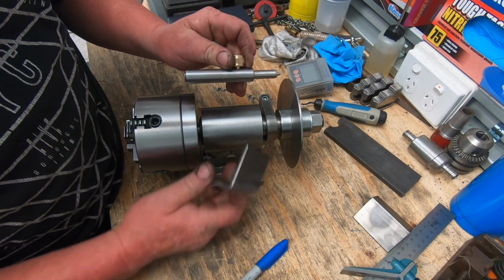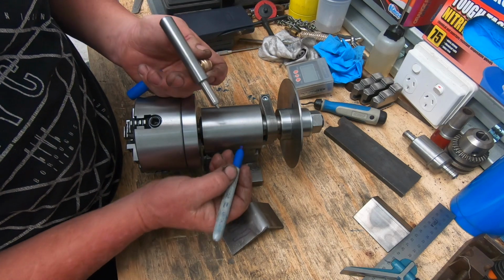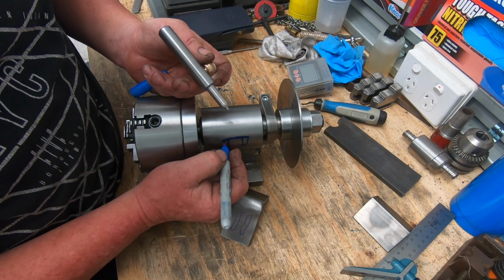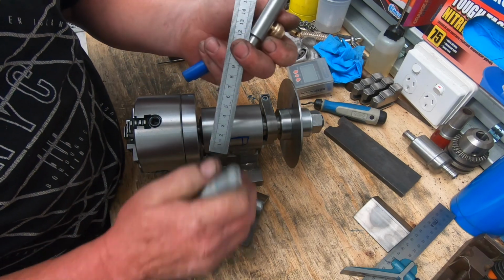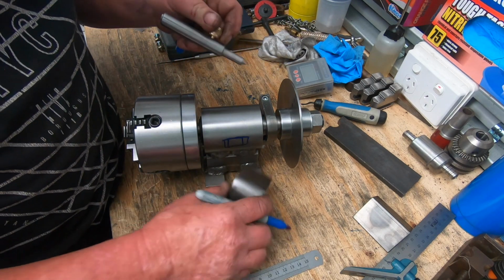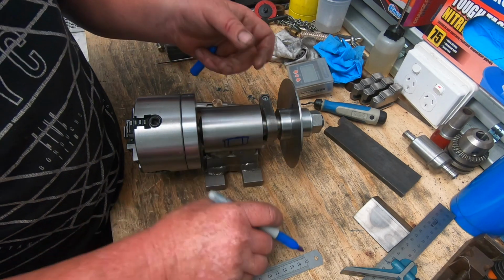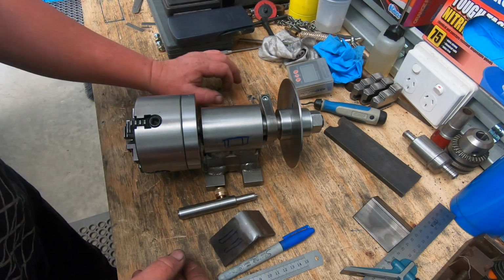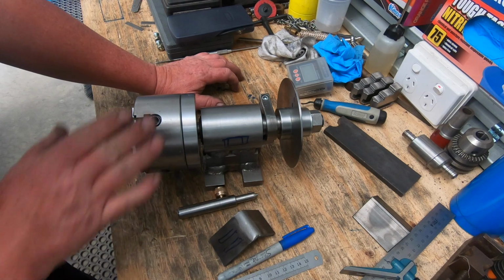So as I said, I'll strip it down and machine a flat in here, as wide as that, probably so wide. I would like, if I can, to get roughly a 20mm flat, or even a 15mm flat, so when it does do up, it'll do back up square, it'll hold square. So that's the plan. Hopefully it doesn't fail. I'll give it over to the shaper and start peeling some material off, and hopefully I don't stuff it up.